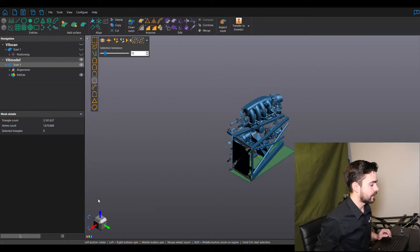Now that we have the scan data aligned, all of our Cartesian views start to make more sense — we have a proper side-on profile and top-down view of the car. The next step is to extract all the entities that we're going to do our actual modeling from. We're not going to be pulling the whole scan data over into Inventor, just the entities. So we need to get the planes off of the mounting surfaces, extract the bolt holes, and handle anything we're going to have interference issues with — so we'll put some planes on that anti-torque bar that we need to design around, as well as the engine mount.